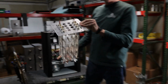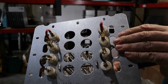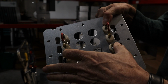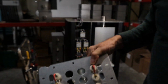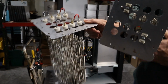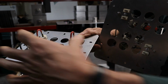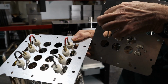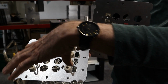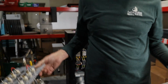Anik, you want to get in here close? Your new heat element is a little bit different than the old heat element if you have the Artisan 9, and it's going to come with these jumper cables on here, and the terminals that you have are in here. If we look at the old Artisan 9 heat element, you'll see that these terminals are separated like this, so it's a little bit different. Just remember, both of the black terminals would go on one of these, the red on one of these, and it doesn't matter which side they go on as long as you make sure to get the wire sets on the color-coded sides, black to black, red to red.